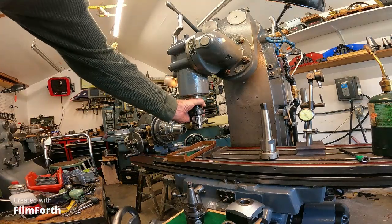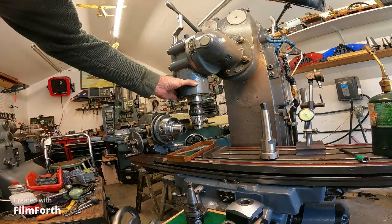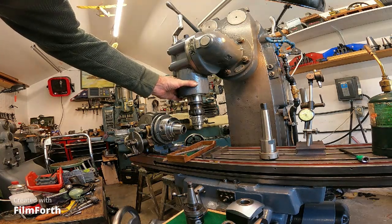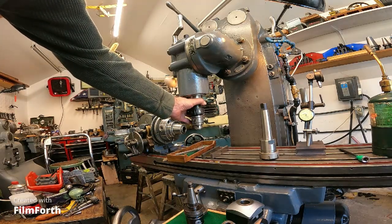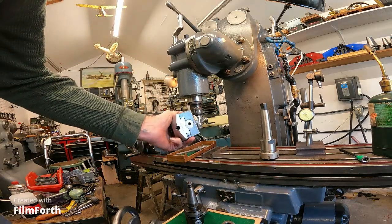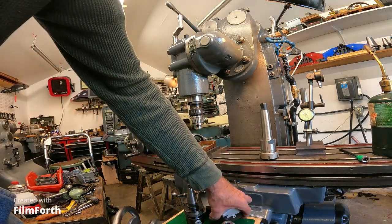And this is, you know, a light-duty head on a heavy mill. And so you just got to do light-duty work with it. That's just all there is to it. And I found, it's kind of a surprise to me with this machine, is that this head's geared up so the top speed's over 1600. And that means I can do a lot of small things with it. So I'm getting another head like this, a square one, the size down. This is like S3, I'm getting an S2.